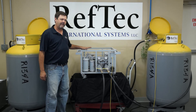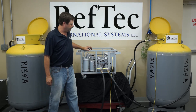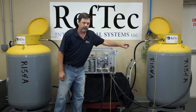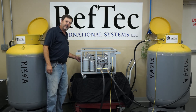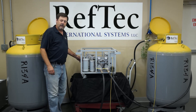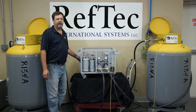The unit will still have refrigerant in it — in the compressor, condenser, as well as in the discharge line going to the cylinder. To recover that refrigerant, you will hook to our suction port on the side of the unit with a quarter-inch Schrader valve, pull it through a standard small recovery unit and into a cylinder under vacuum.